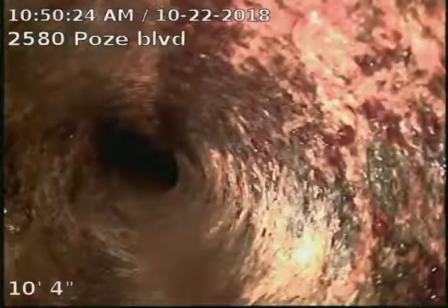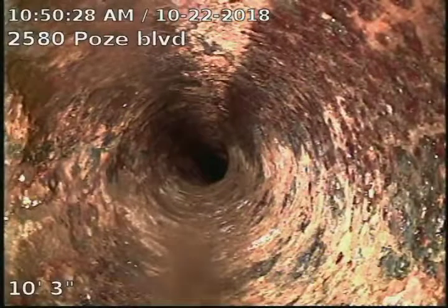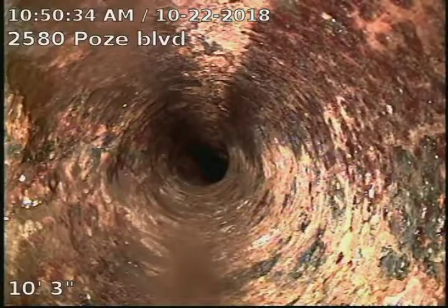This cast iron does transition to PVC. We'll see where we tie in the PVC here — right at about 10 feet. So there's about 6 feet of original cast iron piping underneath the house, and the iron is in perfectly good shape. The new PVC is also in good shape.